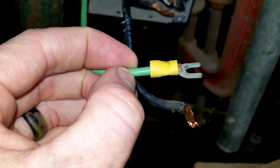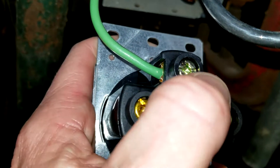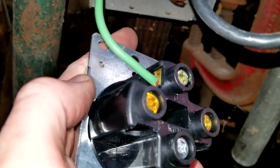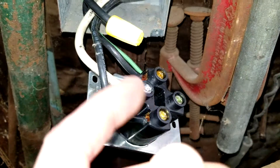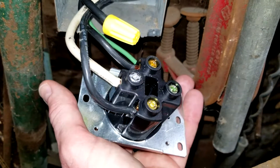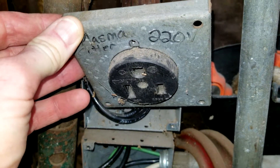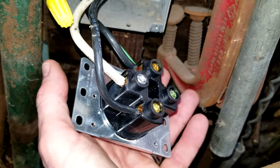I strip it off and insert the green, then screw down the little terminal right on top of the wire — it's nice and tight, that's not going to fall out. The wires going up to the top receptacle unfortunately mean that one is going to be dead. I was struggling to put both wires in the new one — it's definitely possible but I just wanted to get this up and running. I don't think I'll ever use a plasma cutter personally, so I could always redo it. But if you want to take the extra time, get both of them in there.